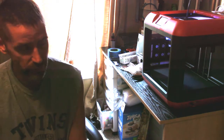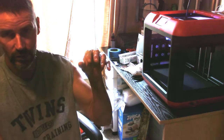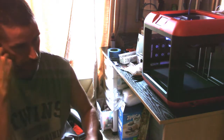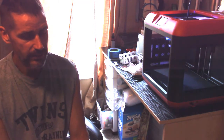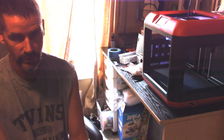As far as the Finder, last night I had to clean the extruder for the first time. It seemed like some filament was jammed in there — I did a filament change and couldn't get it to totally clear the nozzle. So I had to take it apart: you take the cover off, then there are two screws that hold the motor on that drives the filament, pull that out, and that gives you access to the tube going into the hot end. Using tools that come with the Finder, I was able to push the remaining filament through and load some new stuff. It wasn't hard — and it's a good experience because you can't avoid having to clear a jammed nozzle in 3D printing.